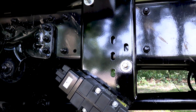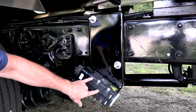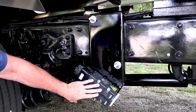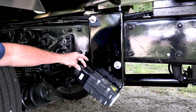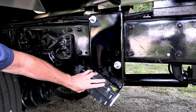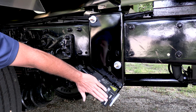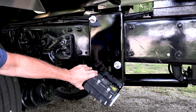That gives us our starting point at 35 degrees. Also remember in maintaining the radar: the radar is water-tight but not waterproof, so stay away with the pressure washer because we have a gasket where the wires go in and a seam in the case — you can force water in which will damage your radar. Once everything is secure at 35 degrees and all is tight, we can go to the cab and do the actual calibration of the radar.